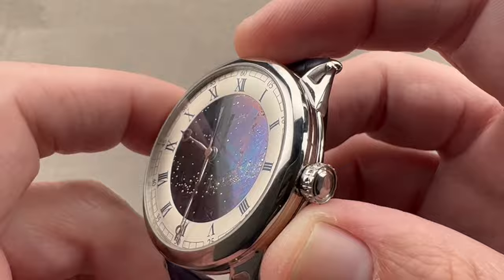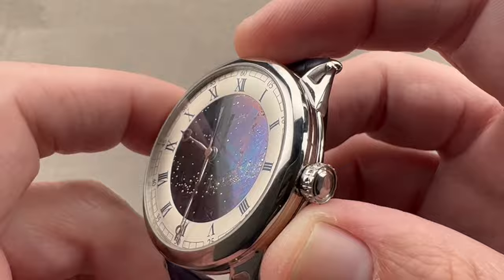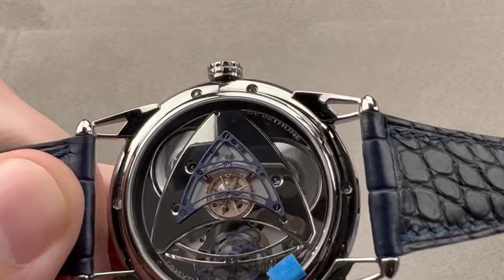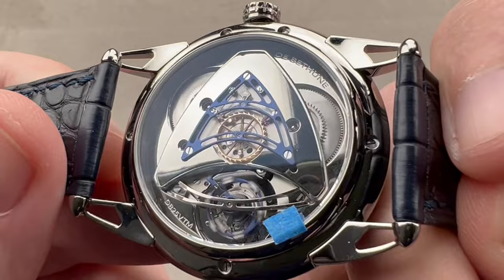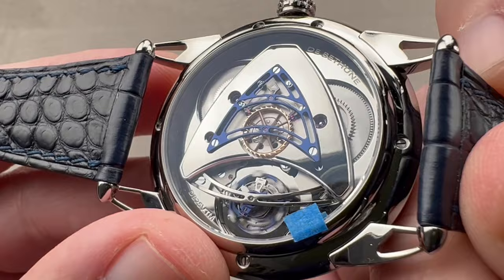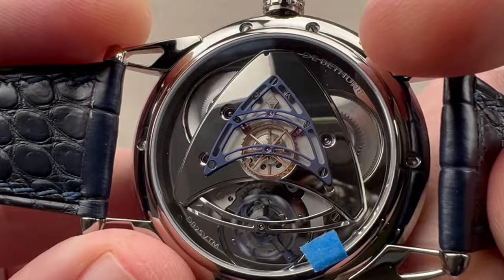Flip it all over — the movement is spectacular. Everything that's black polished has been finished with diamond paste, polished to accentuate its mirrored shine — optically flawless. Whereas most watches feature small black-polished parts like locating pegs, regulators, or screws, De Bethune gives you acres of black-polished steel with mirrored bevels on the edge. Though avant-garde in design, the finishing is very traditional. Technically: manual wind, four-day power reserve, twin barrels — self-adjusting and patented, so you cannot accidentally overwind them.